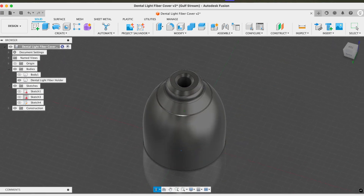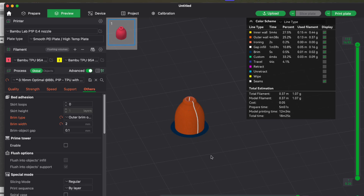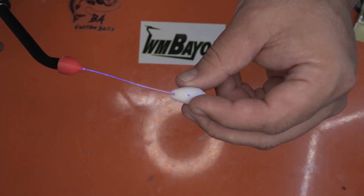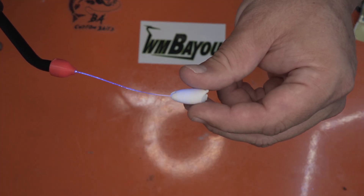With this add-on — a little model I made, link in the description — I print it with TPU, which is a bit more forgiving when you slide it on. I glue a small piece of plastic fiber optic cable on there, and then you can get just about anywhere. This is half-millimeter fiber optic cable. I also made one with two-millimeter fiber optic cable. It's still bright, still transmits light, with a little light leakage out the side, allowing you to reach areas that are really difficult to get to.